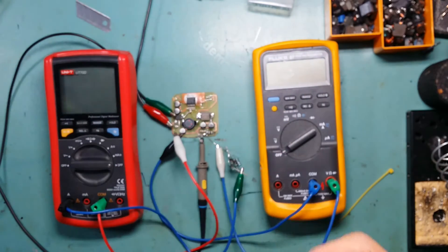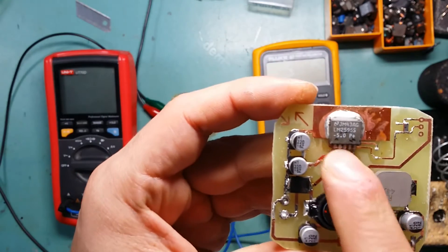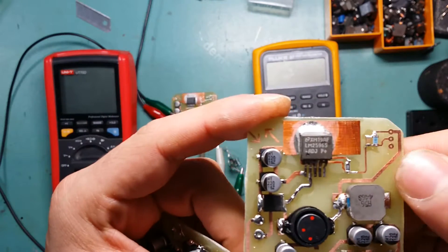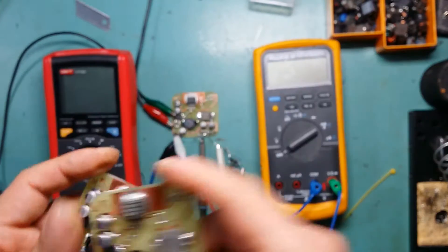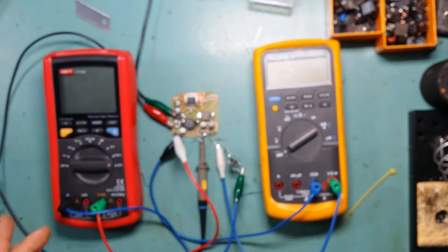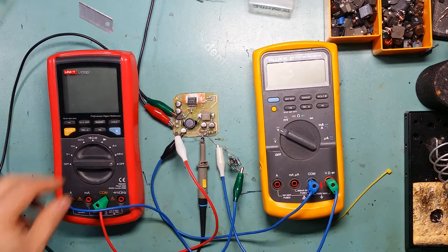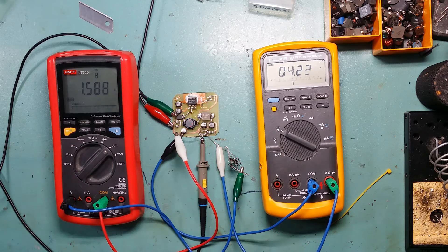The Arduino runs on five volts. I have a few versions of the DC-DC converter where I can adjust the voltage, and I've got three of them set to five volts. I can select the output voltage with this resistor here. I'm going to show you the ripple on the output of the DC-DC converter. These ICs can run up to about two amps without any problem.